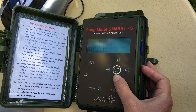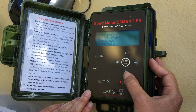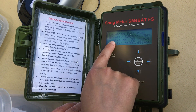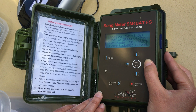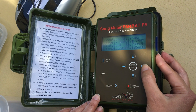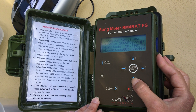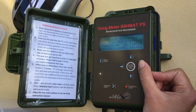So now it's turned on, you'll get to the main menu. To input your grid reference, you'll want to scroll down with these arrows here to Settings and press enter. Go down to Location and press enter again. The only thing you'll want to change is the prefix here, because we've set the latitude and longitude ourselves to your nearest host centre. To do that, scroll to the right, keep pressing, and change these two letters and these four numbers. So if we change to SY 76, then 8, press down 7 — that's all good. To save that, just press right one more time to go back.